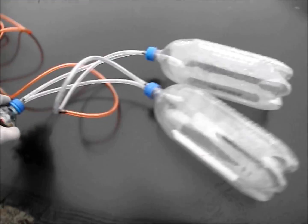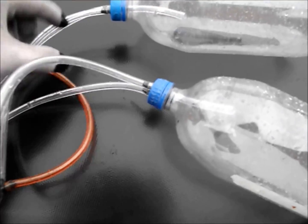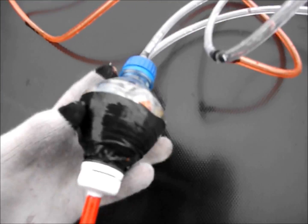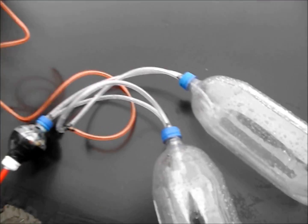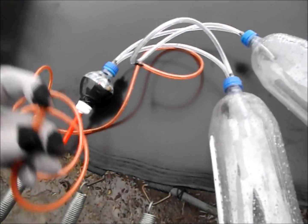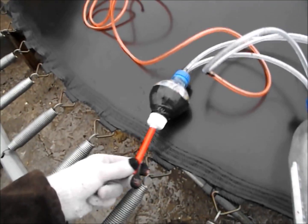This is just after the water test. I've gotten all the duct tape off so you can see what's going on here. Here are my propellant tanks. The tubes from those come down — there's one for each — that goes down into this reaction chamber. The reaction chamber is full of glass marbles that'll help stir the reactants. Once it reacts, it'll be ejected out this nozzle here. It's very simple — made out of plastic bottles. To get the reactants into the reaction chamber, I've got this that I can hook up to an air compressor, put about 100 psi of air through it, and that'll force the fluids into the reaction chamber so they can react, ejecting the material out here.